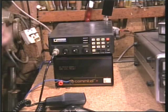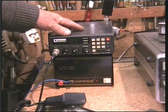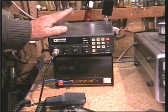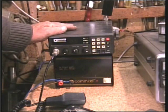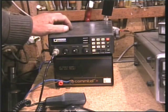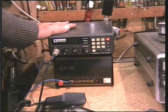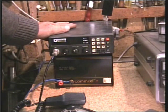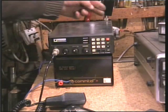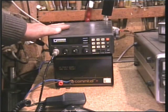At one time I decided to offer a service repairing marine band radios, being a ham and so forth. But that didn't last too long — I found I was pushing water uphill most of the time. I found that 95% of all faults with transceivers were installation — mainly poor aerials. People just didn't understand impedances, dummy loads, and so forth. I was fighting ignorance all the time.